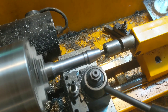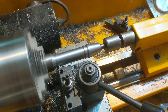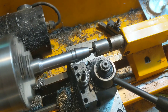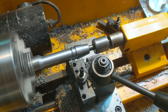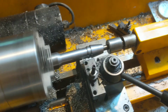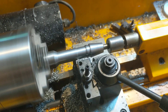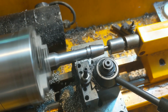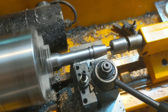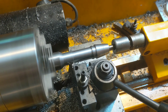For scale, that shaft is one inch in diameter — I know it's probably kind of hard to see. Well, that's pretty smooth. Now after this cut it should go back to the beginning and make a finish cut, if I did it right. This is also constant surface speed, but I have the spindle cap set to like 900 RPM. I could go faster I guess, but this seems to be working good.